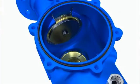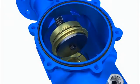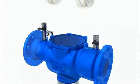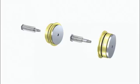Repeat steps for inlet check valve. Tension the springs of both removed check valves and loosen the nuts. Remove stems and valve cone.